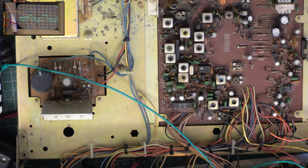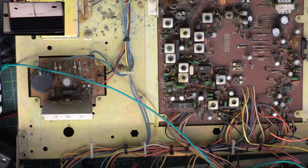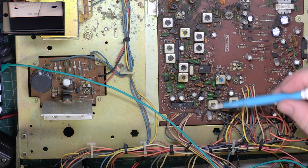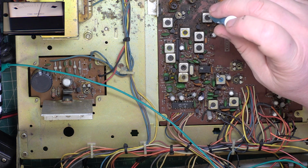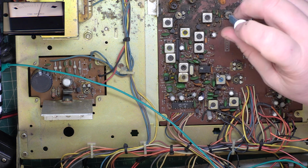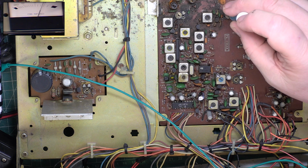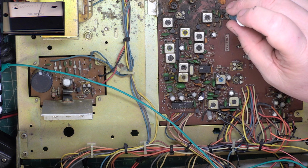Now then, we'll go over to the sinad meter, and let's hope we can get a bit more out of it. So we've got 2.5 microvolts to beat, so we'll get the attenuator adjusted so that that's round about 4 dB, and they want you to go that way, I'm going this way. So that was already spot on.